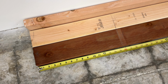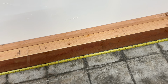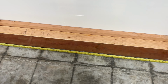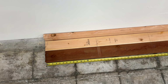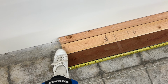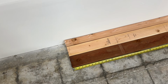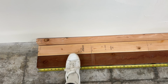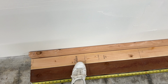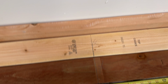I wanted to show you guys how I'm measuring the framing studs and the ceiling stud. That way I make sure that the studs in between that form the wall are all lined up. Essentially, from all of the tutorials I've watched, we always want a stud at the start of the base and the top. And then I measure 15 1/4 for the first one. That way it's about 16 inches apart.